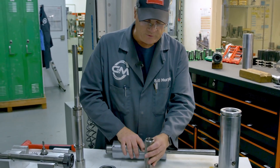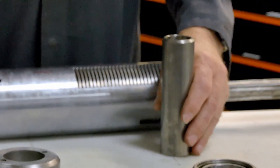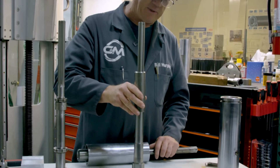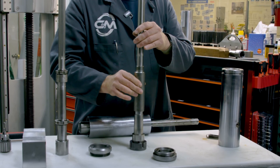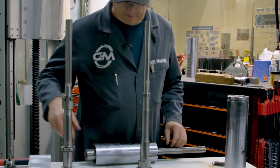These center spacers don't fit as well on the shaft as you would think. They jingle around too much, and when you tighten up that last nut you want them to be fairly tight so there isn't an out-of-balance condition when you're running. It's a little thing but it's really important.